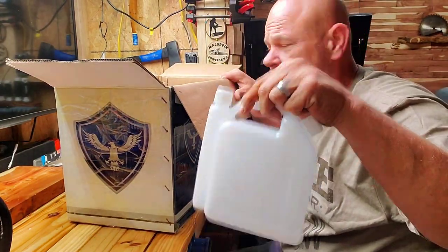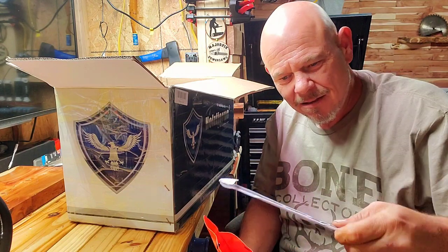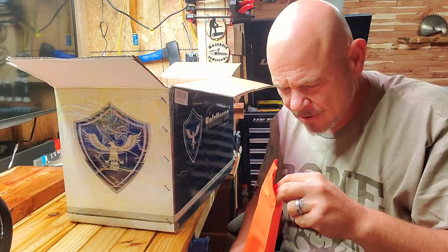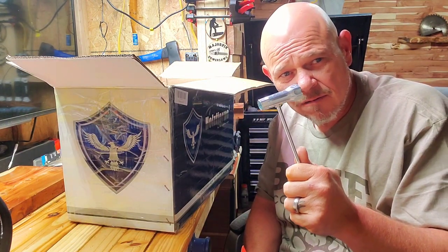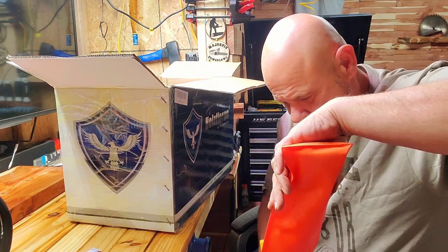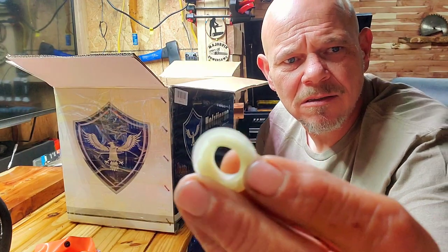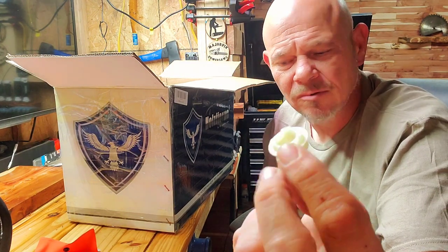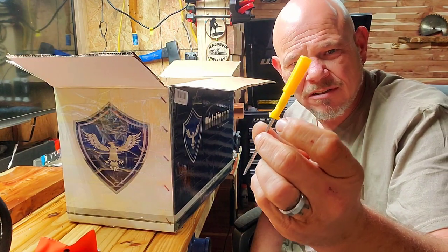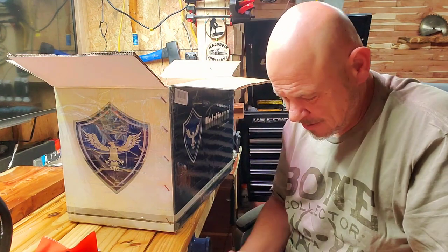Here we go - one of our trusty mixing bottles, and a very cool yet sleek toolkit. So here we have a file sharpener, a chain sharpener, and a wrench - I always say, paint this a neon color so if you lose it you can find it. And we have what looks like a worm gear - pretty sure it's an extra worm gear for an oil pump. We'll find out. We also have a carburetor adjuster, which - by the way - I found out that the one that came with the 288, when you try to go in to adjust the low jet side, it goes up against the plastic and doesn't really work well. I use my screwdriver instead.